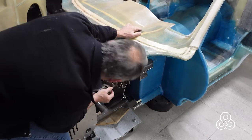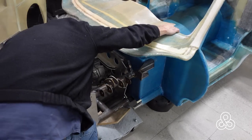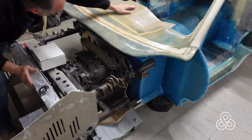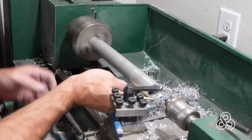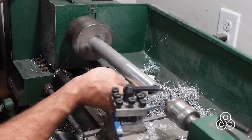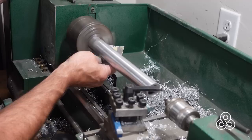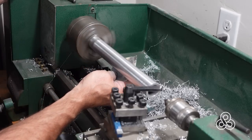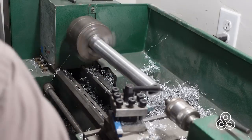All of this hinges around getting the front subframe in place. It fits nice and tightly around the footwell area and is all reinforced through there, which allows me to get the final bolting in place to start making these parts. This hinge assembly is going to be made out of a piston and a cylinder — the cylinder made out of aluminum tube. I just chucked it up in the lathe, gave it a good cleaning, ran some sandpaper down it and made it nice and shiny.